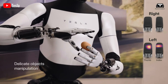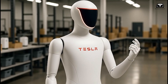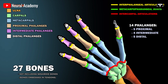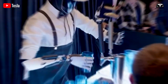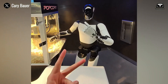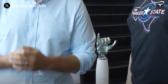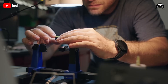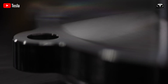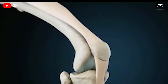Compared to Gen 3, which featured 22 degrees of freedom, the Gen 3.5 hand is expected to reach 24 or even 25 degrees, approaching the 27 degrees of freedom found in a human hand. This advancement enables more complex gestures such as wrist rotation, finger flexion, or highly precise grasping. The biomechanical actuation system places components in the forearm and uses elastic cables to drive the fingers, mimicking the human muscular system, which helps reduce hand size while increasing flexibility and energy efficiency.